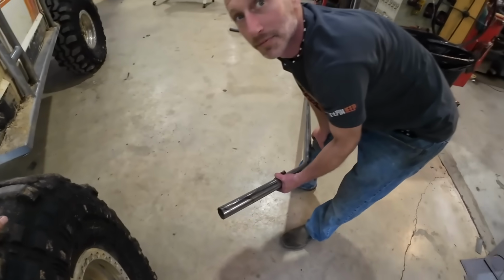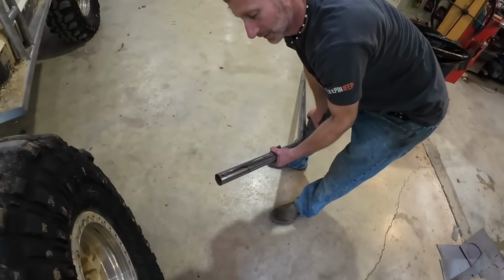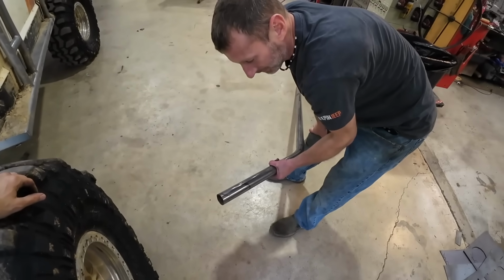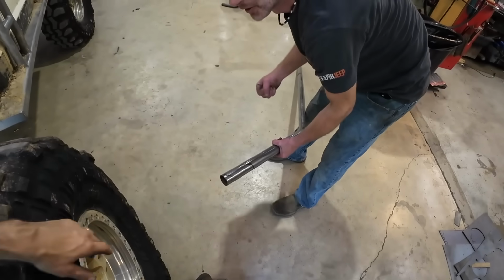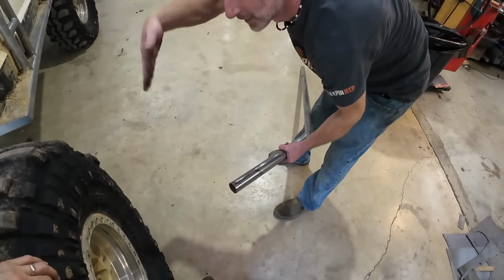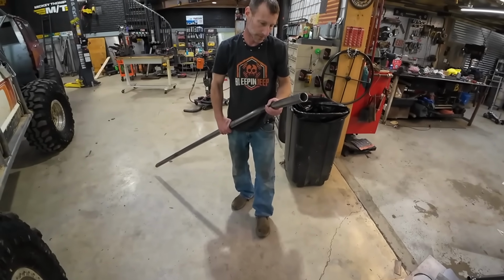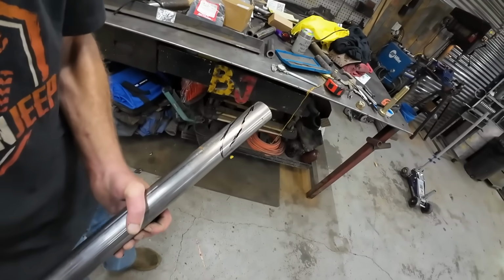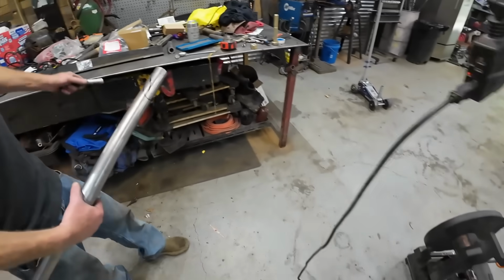If it were me, I would cut the angle on the chop saw, which you're going to have to do anyway before you notch it. But I would just get it close with the angle grinder instead of trying to notch that, because it's so long, it's going to be hard to fit. Oh, yeah, you'd have to go in and cut it, and then go in and cut it again. So probably cut it a half inch long. That's the angle. But that's the cut line. Got it.